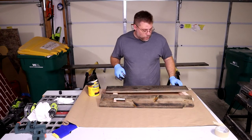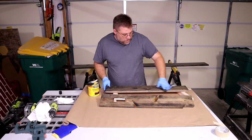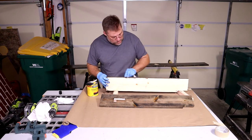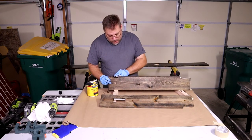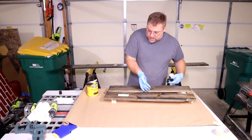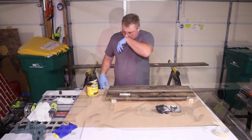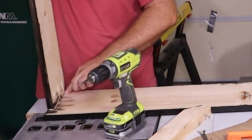That's a pretty good color but I am going to go ahead and put another coat on this because I want it a little bit darker. What you don't want is to let the stain pool and harden unevenly. Our furniture is black so we want it a lot closer to that dark finish. We'll go ahead and restain it to get it a little bit darker — I think it's going to turn out pretty good.